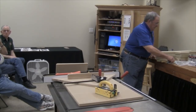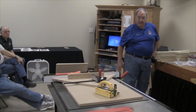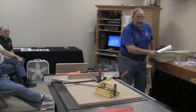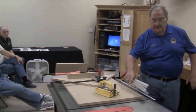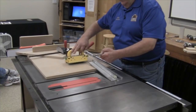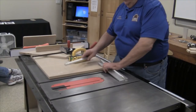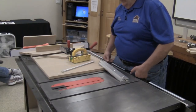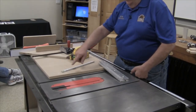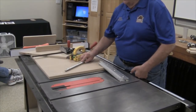All right, what you're going to see us do here is each of these flat pieces, we're going to wind up attaching guide bars to the bottom of them. For the guide bars, what I prefer to use is a guide bar that is produced by Craig. This thing normally comes in a pretty sizable length. What I do is I take them as I get them, cut them into parts, and machine off the end to receive this step washer.